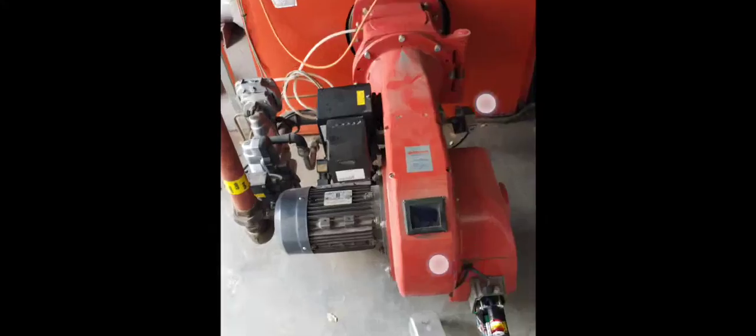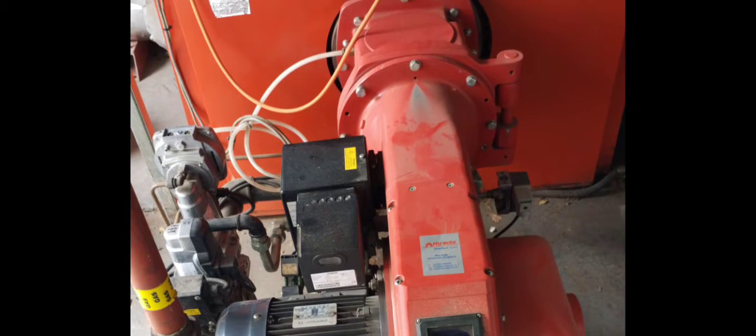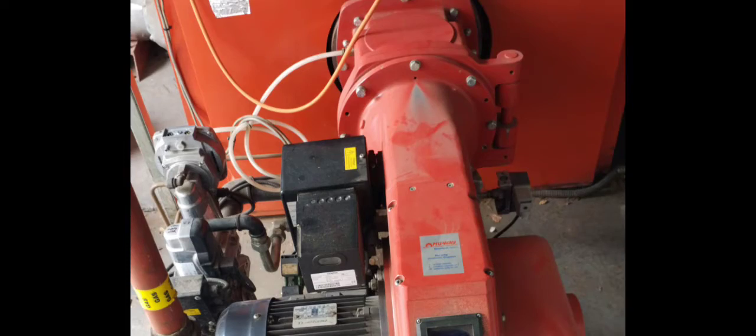Here is a pressure test — I've got it set to air and gas mixture, but you can test them separately. You can attach your gauge over here on the air going in to see how much air you've got, and also check around the other side underneath to see how much gas is present before they are mixed together.